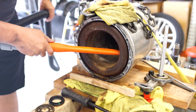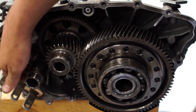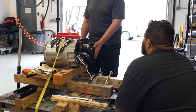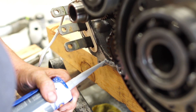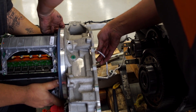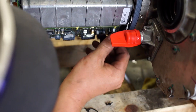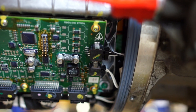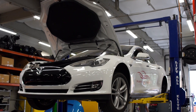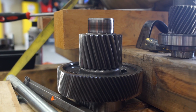He also power washed the other parts and cleaned off any bits of rust on the smaller parts. After a final brush and vacuuming up the dust, it was time to put everything back together and test it all out. The gears were working well. We then needed to reseal the drive unit halves with our gasket sealant. We fed the temp sensor cable back through and put the drive inverter back together. Now it was time to test out the car. Thank you so much for watching our videos and please subscribe to our channel.